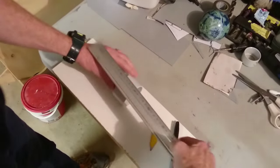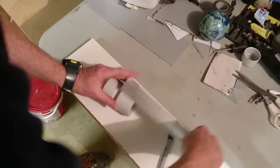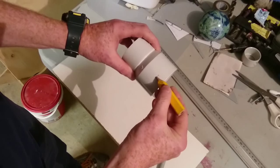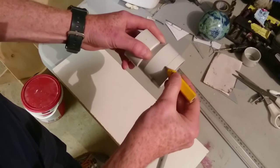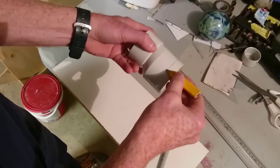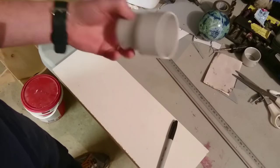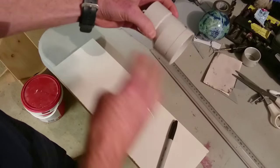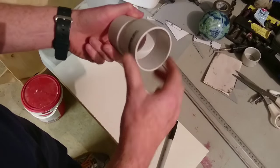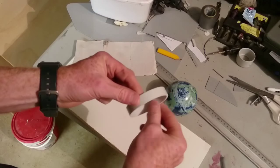The first thing I'm going to do is mark 15mm around the edge of this ring. Then I'm going to do a thing called finger gauging — I've shown you this before, but basically you go with the back finger here and run it on the edge. You put the lead of the mark and then you just run your fingers around like that. As long as you don't move your hands or fingers, the line stays nice and straight. As you see when I get around the other side, if I did it right, it should line up with my original mark. I'm going to cut that out with the hacksaw. When you cut it, don't cut all the way through because your hacksaw will wander — this is Perspex. So cut through the thickness, turn it, cut through the thickness again, all the way around, so your line stays straight and it'll be perfect.